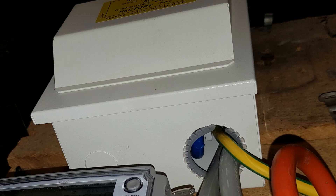This is a real shame because it's a brand newly installed consumer unit. It's really a problem and something definitely to look out for when you're doing an EICR. I always check the bottom of the consumer unit to make sure there are no holes big enough to get your finger in, and the top of the consumer unit to make sure there are no open knockouts at all, to prevent any ingress of dust, objects, or particles.